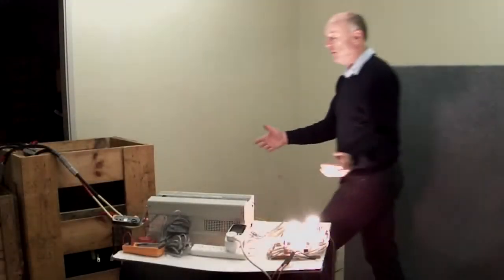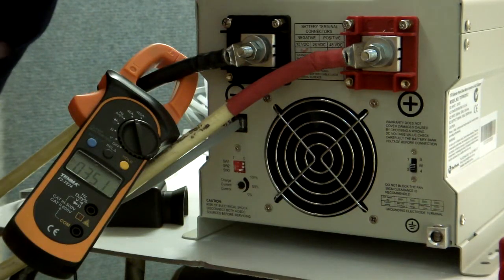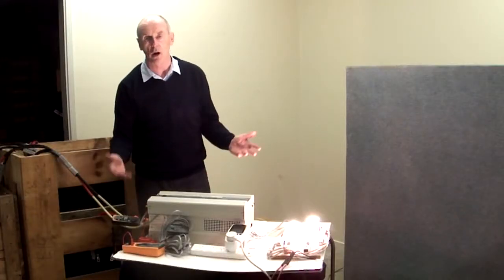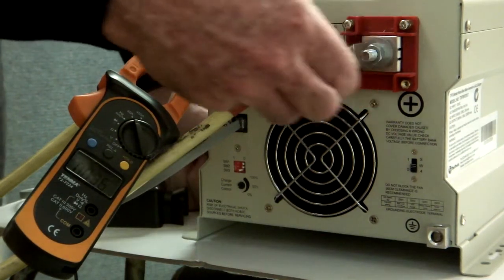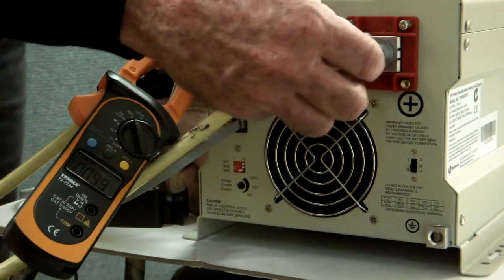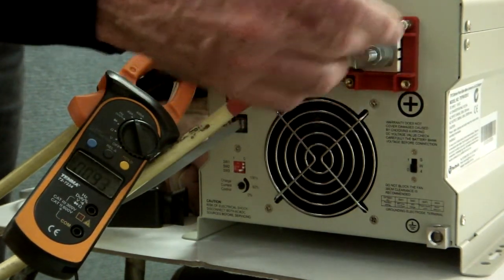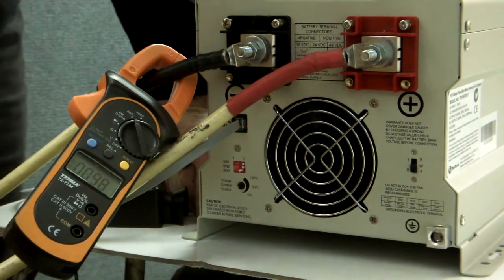One of the big advantages of this inverter is that it's got very large pads on which to mount the DC terminals, so you'll find even if you touch this when it's running at 190 or 200 amps or even more, the current is easily taken into the inverter. It's connected not by cables but by bus bar from the inside, so these connections and the method of termination into the internals of the inverter are very solid and very substantial.